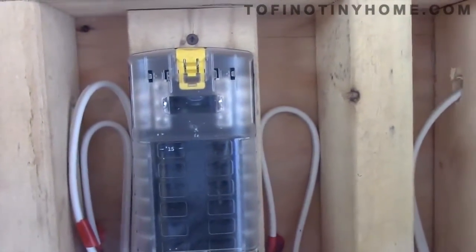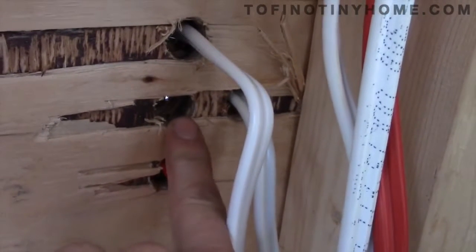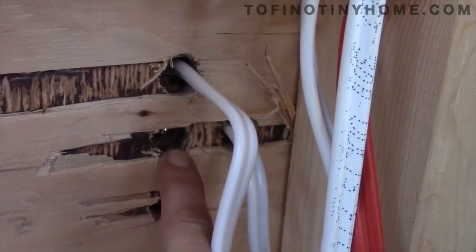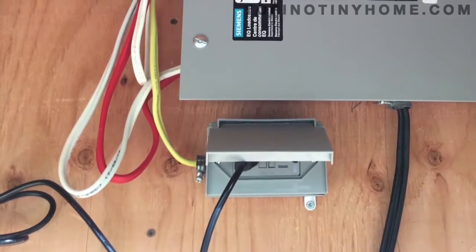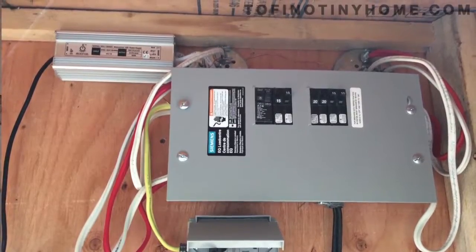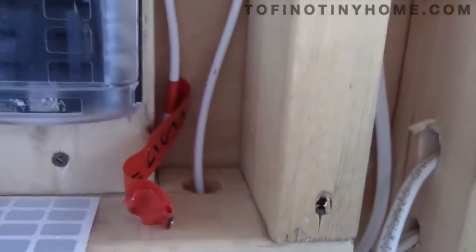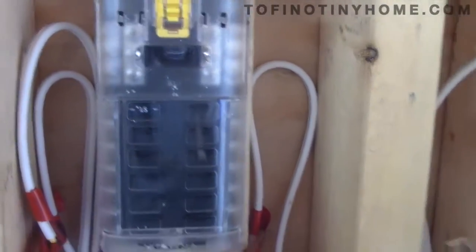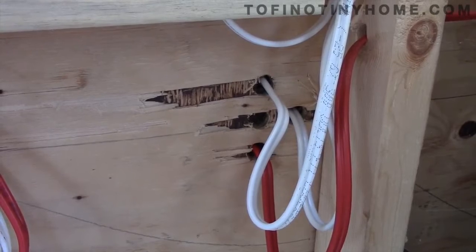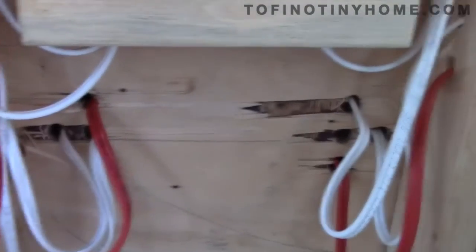This is the 12-volt breaker box, which is going to be separate. There's another wire coming in — I've got a spare hole here which will bring in the wire from the transformer. Power will go from the breaker in the 120-volt breaker box to an outdoor socket outlet, then I'll plug in the transformer to that outlet and bring the 12-volt from the transformer through here to wire up the 12-volt breaker box. I used a five-eighths drill bit for those three holes, which are lined up with an octagon box on either side.